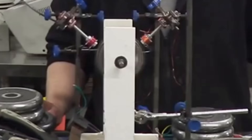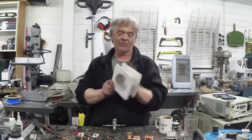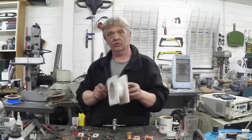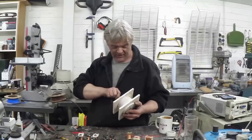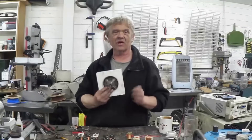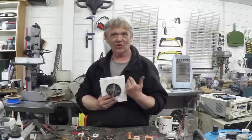Now what I want to do is take exactly the same arrangement but turn it into a generator. What I've done is put a housing together out of builder's board — Sintra board — just a drum, really. And that rotor fits rather beautifully into that drum, nice and snugly. Now all we've got to do is surround that with coils.